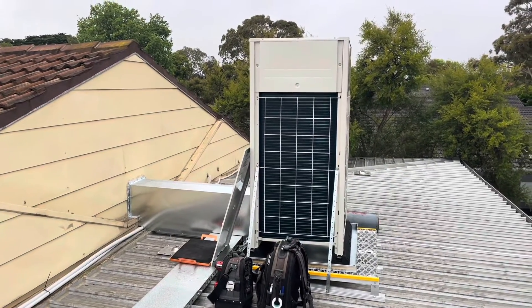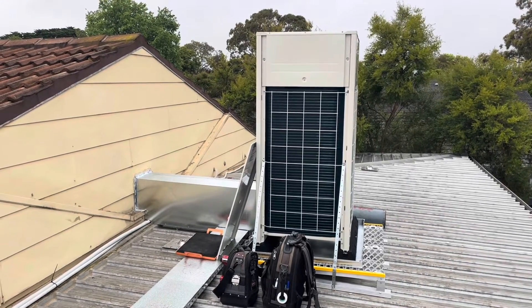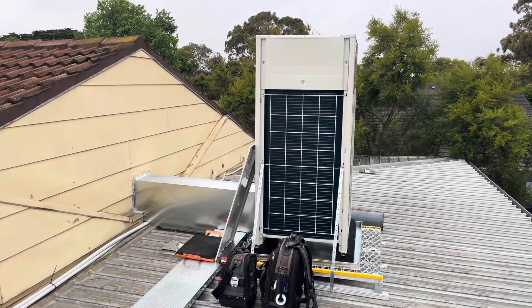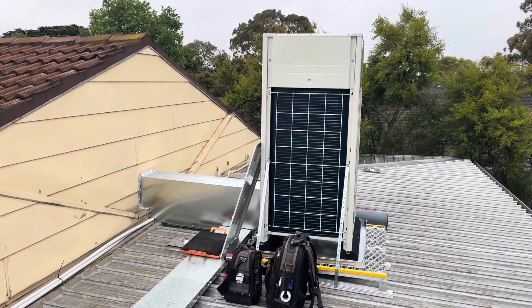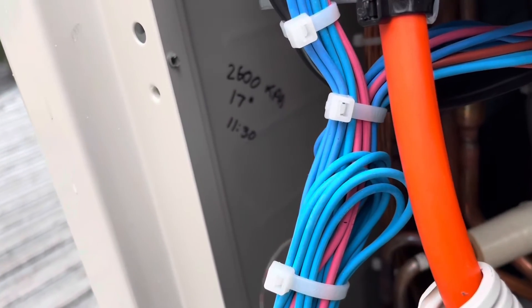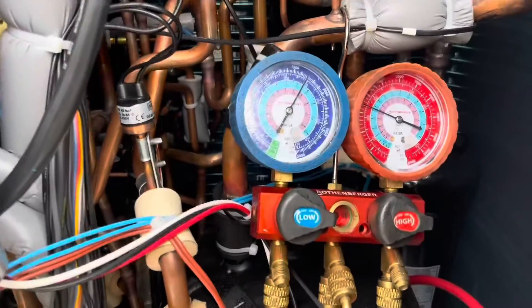We're back — it's the next Thursday, so the 1st of December. The mechanical boys have still got a little bit to do, but pressure's in the system and I'm here to make sure that there are no leaks and get this thing back on today, maybe even charge her up. Someone's very kindly left their gauges here. Looking over here — 2600 kPa, 17 degrees. I've got a formula to work out exactly what the pressure drop should be, because it is a bit colder than that. However, I have a feeling we're going to have an issue.